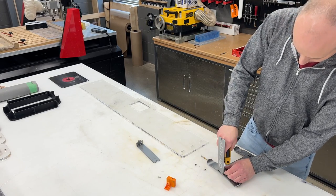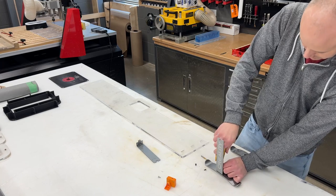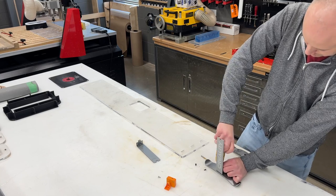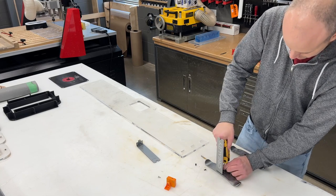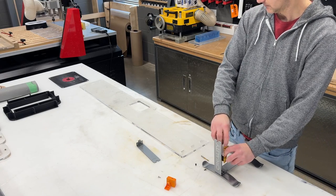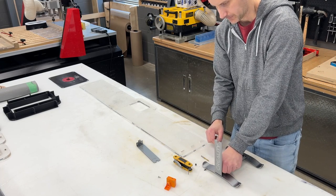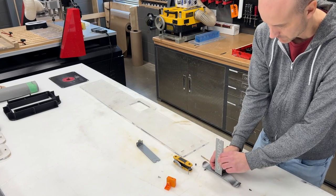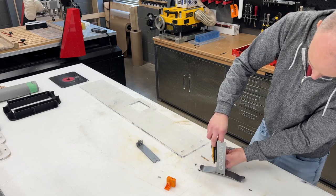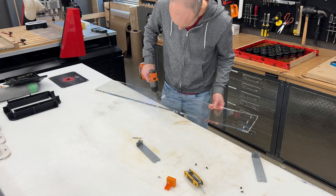I had that Creality spool holder so I'm going to take the sides off it. I don't need the base but I mimicked the holes in the actual acrylic that I have here. So I'm going to unscrew this — I didn't have any M2 Allen key with me so I've got these all-in-one Allen keys which are a real pain in the butt to get into tight spaces, but I ended up getting them off anyway. They have three screws on each of these posts but I'm only using two screws. In hindsight, I didn't make the holes big enough to start tapping in the acrylic. I ended up stripping it and had to glue them down anyway.